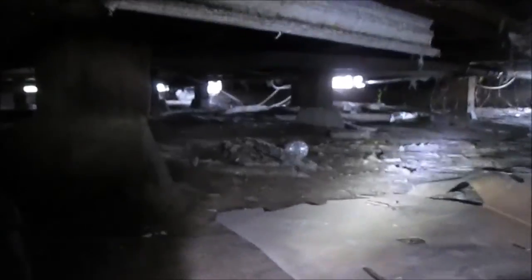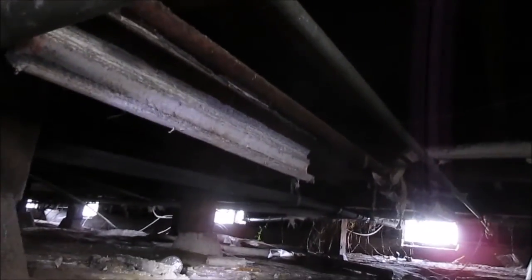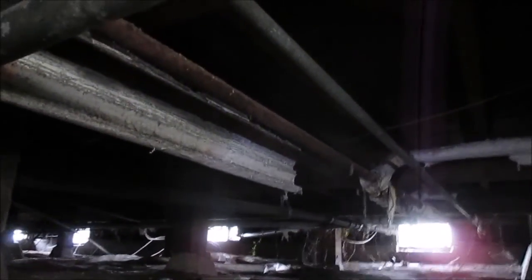This is kind of hazardous here — we have asbestos pipe lining, which should have been out with the 50s. The clog is right about here, somewhere in the middle, and my snake goes to about here. I'm going to have to bring my electric snake because I can't seem to push it by hand.